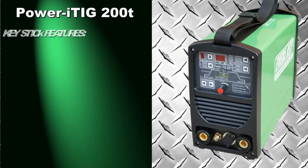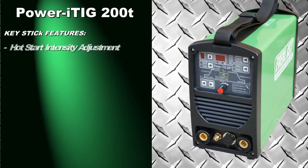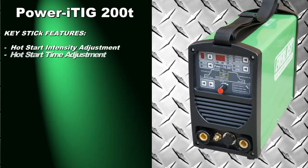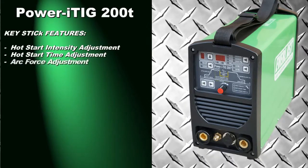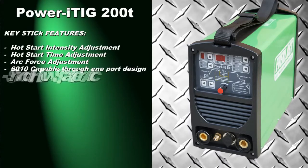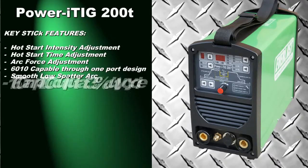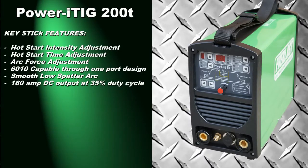The Power iTIG 200T digital control over the welding arc in stick mode includes several key features. These include hot start intensity, hot start time, arc force control, 6010 capability with a conventional one port design, a smooth low spatter arc, and up to 160 amps DC output with a 35% duty cycle at maximum rated amps.